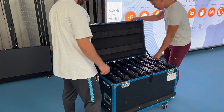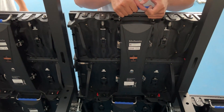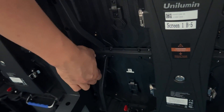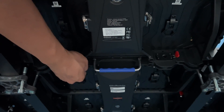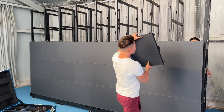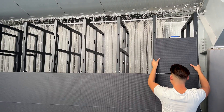Once you're done with the first row it's time for the second row. Same thing here — this is the B row and we start with number one. When you set up the upper systems, they lock into place using the little pins. Make sure you interlock them side to side with this little connector, and make sure the red little things interlock as well. Once you're done with the scaffold, just continue to put them up like big Lego bricks one by one. Always start from the right side.